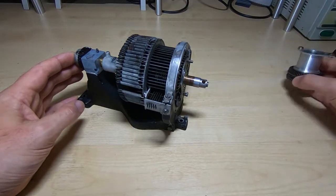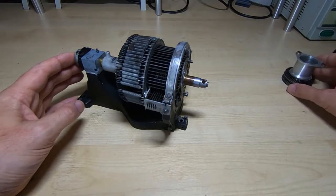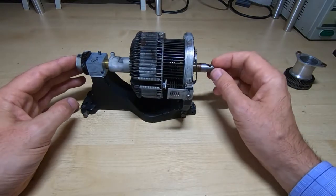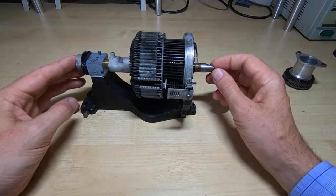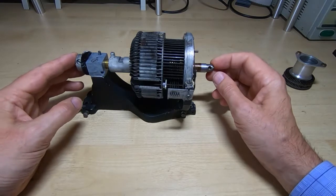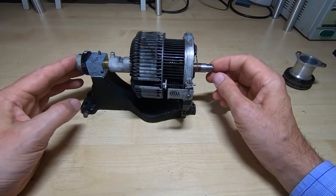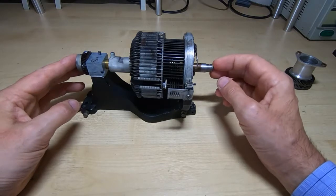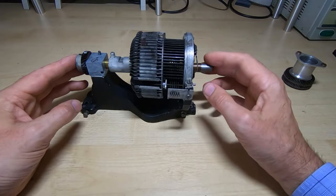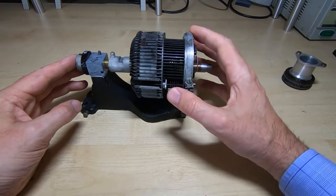But the teletype overall is controlled by sending it a series of pulses, 0 or 1 pulses, and all they do is they energize or de-energize a solenoid, and we'll look at the solenoid in a future video. But those pulses have to be turned into a code that can be used to select the character that it wants to print, and that's where this unit comes in.